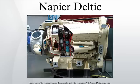The Deltic engines were used in two types of British Rail locomotive, Classes 55 and 23, built in the 1960s. Because of their engines, these types were nicknamed Deltics and Baby Deltics respectively. The Class 55 used two D18-25 Series II Type V Deltic engines, mechanically blown 18-cylinder engines each rated at 1,650 horsepower continuous at 1,500 rpm. The Class 23 used a single less powerful nine-cylinder turbocharged T9-29 Deltic of 1,100 horsepower.